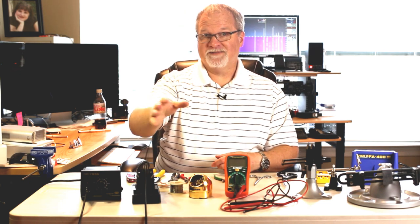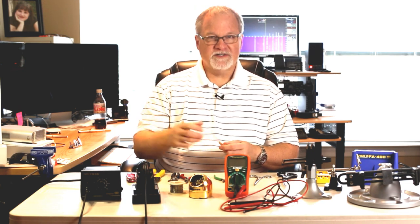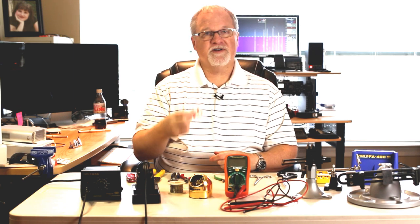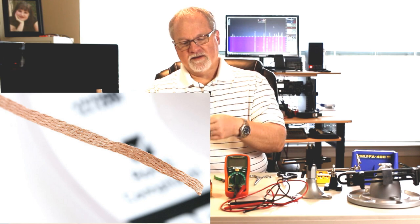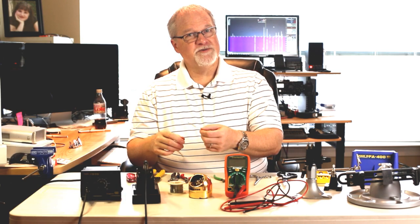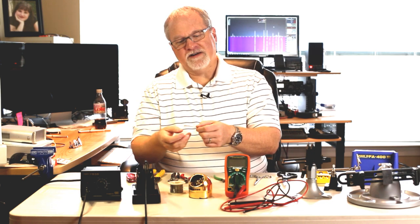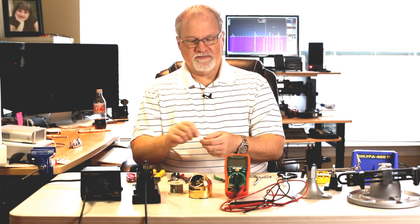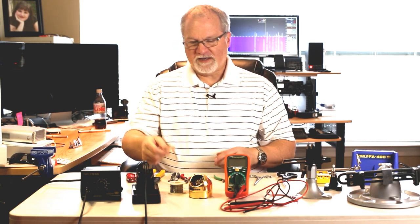You're going to make mistakes, and when you do you need a way to fix them. One thing you can use to suck up solder off a circuit board is desoldering braid, or soldering wick. It's a little copper braid that you lay on the board on top of the solder you want to remove. As you heat the braid, it heats the solder and sucks it up into the braid. Then you just cut that section off and keep using a new piece each time. It's really great to use.